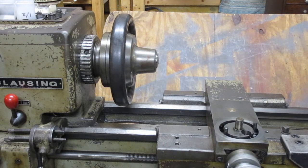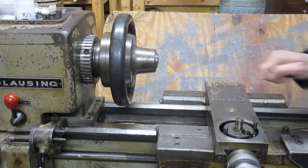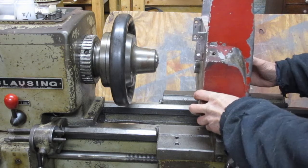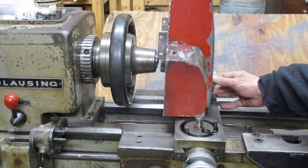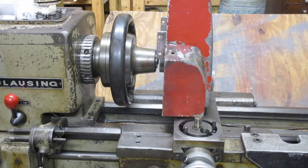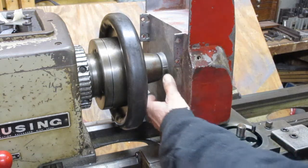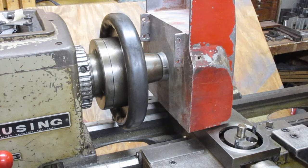So hey, I got some bolt holes on this little carriage. I don't know if they were originally in there, but there's 4 tapped holes right here. I just barely got enough room. I just happened to have this collet chuck on there, and it turned out to be about the same diameter as this part of the casting, so I can use that to line things up.